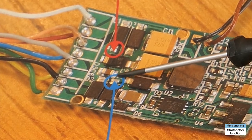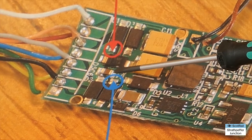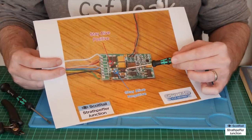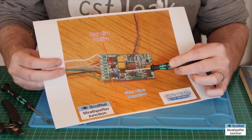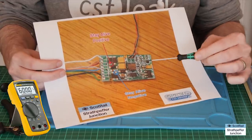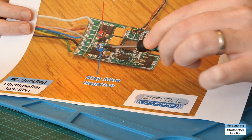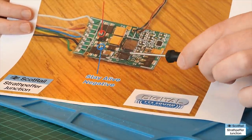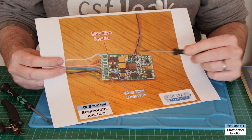The negative side is not so easy because it's very fine — it's a small surface mount component with a lot of potential to mess it up. I had a look on the internet to see if anybody else had done this, and there are one or two threads. I also probed about with my multimeter to see if this track went anywhere else — and it does, which is excellent news. This track appears on the other side of the decoder, and there is a pad that we can solder onto, so I'll get another diagram and we'll have a look at that particular pad.